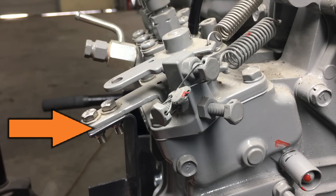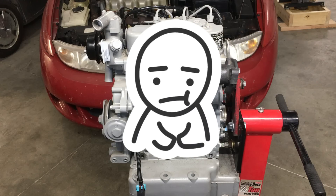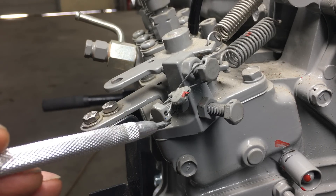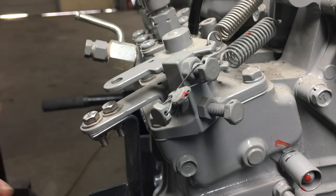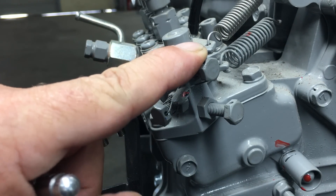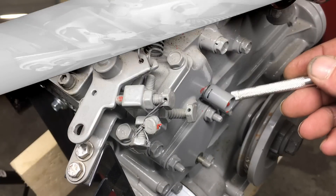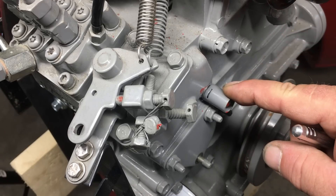The throttle on this engine is located here. Instead of throttling the air, the throttle varies the amount of fuel that's being injected. It's a very complicated system to service, and thankfully this is a new engine — relatively new. This engine's been sitting for nine years, so today, if it all goes well, the engine will start for the first time since it left the factory. This screw sets the maximum speed at about 3,600 RPM, and this screw sets the idle speed, which on this engine should be about 1,000 RPM. This lever up here is for the fuel shutoff valve — it's spring-loaded in the off position. Down here under the tamper-proof cap is the fuel adjustment, which we'll leave alone for now, but when we add the turbocharger we'll probably have to adjust this for best performance.